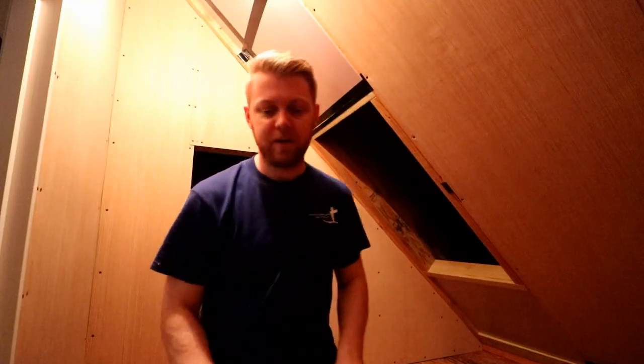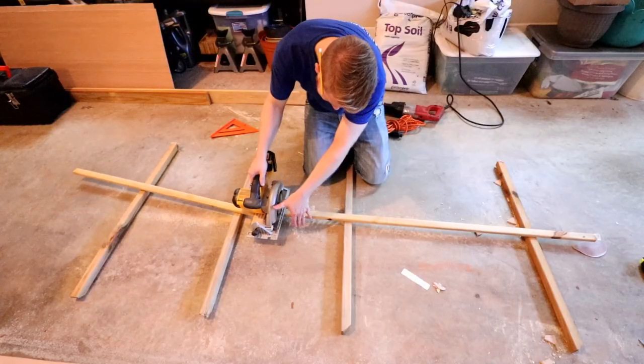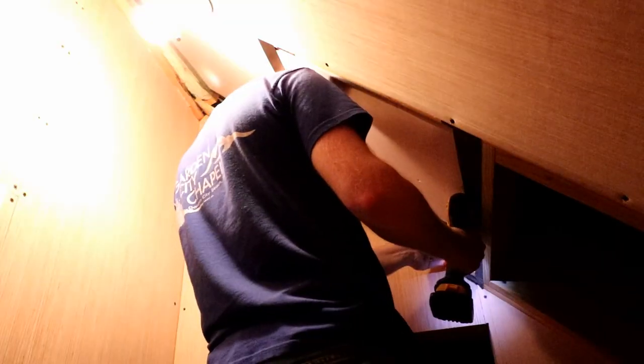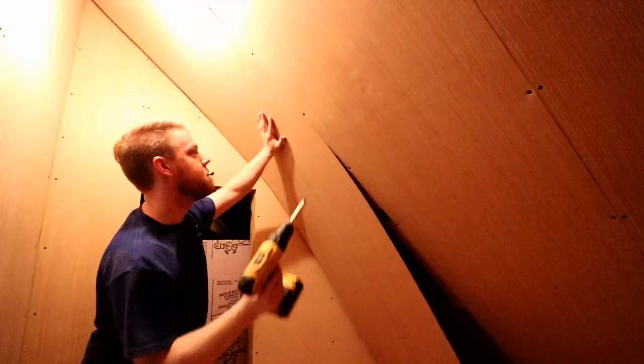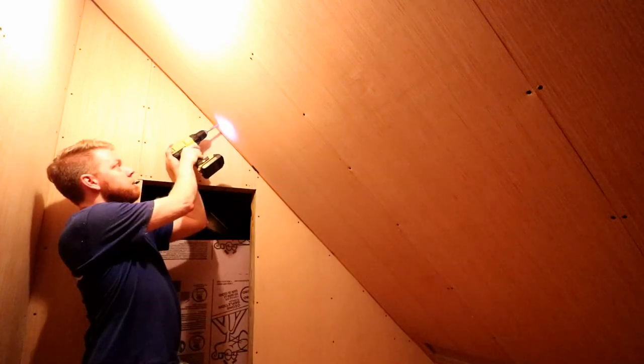Since this piece is going to come up a little bit short, I'll take this strip of 1x2 here. I screwed my insulation back just enough for the thickness of that 1x2, and I'll just cut little strips, pre-drill them through, and that'll be what the sheet attaches to — that should work fine. I'm going to wiggle through and trace that hole on the other side. I'd take you with me but you won't be able to see anything.